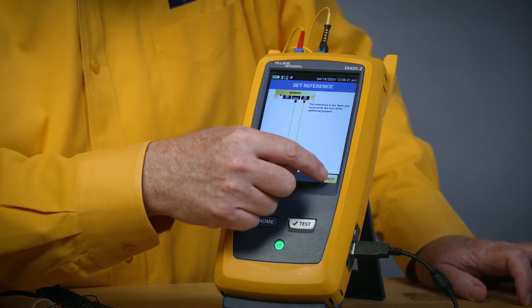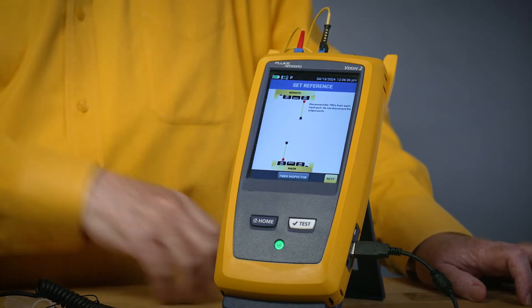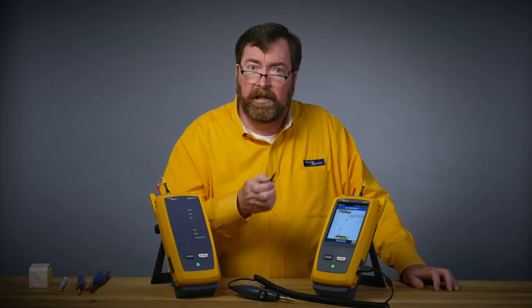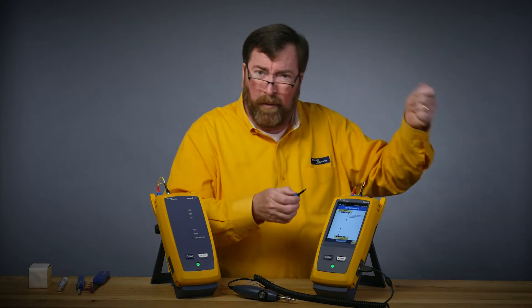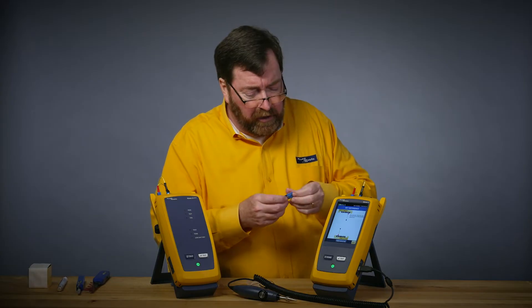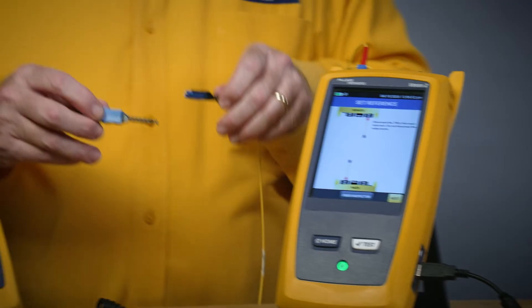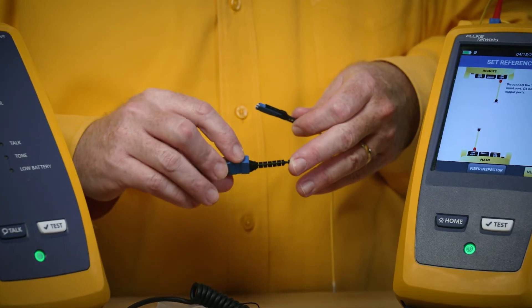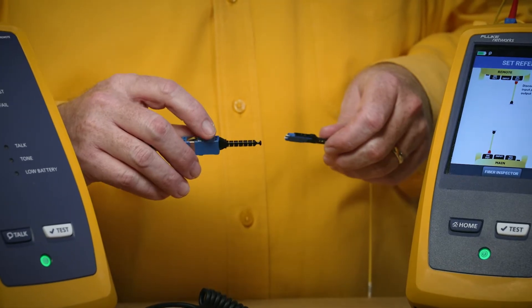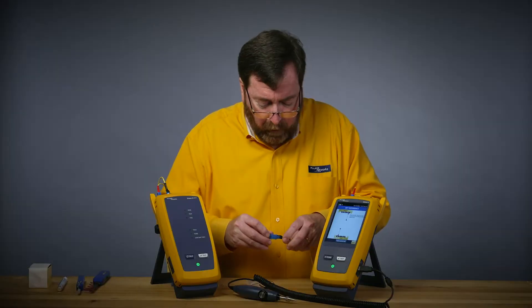Go back into our test. Next, it's going to show us to disconnect from the power meter. Here's a trick: when I disconnect from the power meter, think about where you're going to go with the fiber — you don't want to wave it around and get a bunch of dust on it. So I'm going to put these into this coupler. On the coupler, I'm looking for the side that has a hole in it, and I'm going to align the side with the hole with my key that's going across the top of the connector, then plug that in.